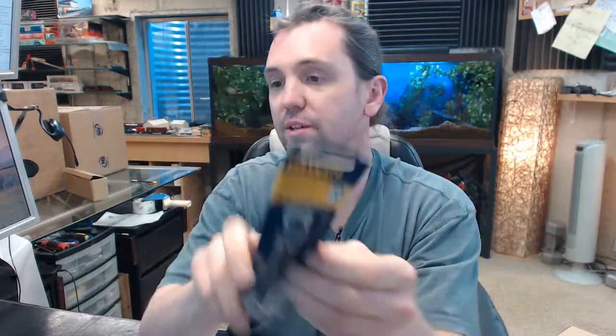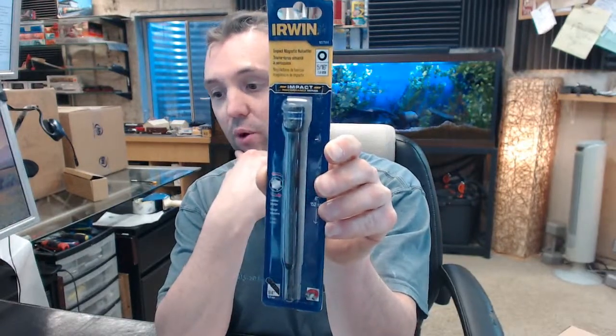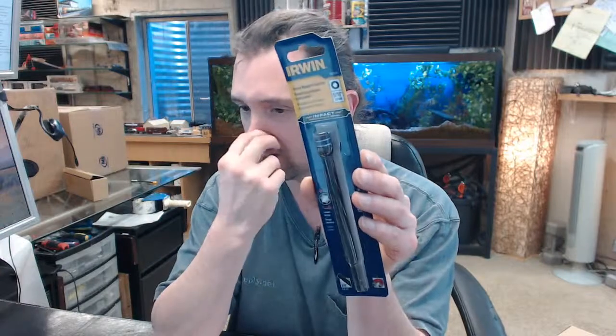Lobular is a reference to the design inside, which you can see in the stock image from them. It is designed to drive the fastener from the side rather than forcing the corners to turn, maintaining the true shape of a fastener. It grips the flattened portions of the nut — whatever you are driving — rather than the outside corners, so there is less opportunity to round the corners. There are no inside corners in this design, which allows it to work very well.